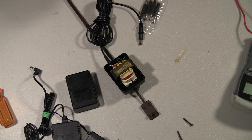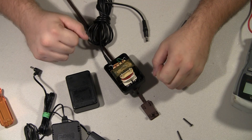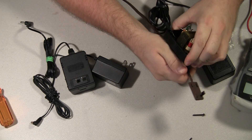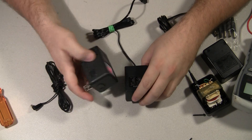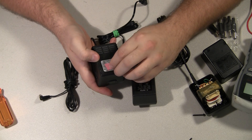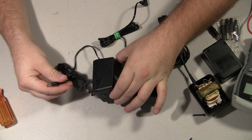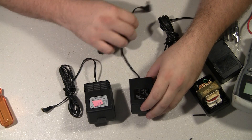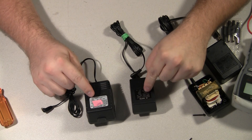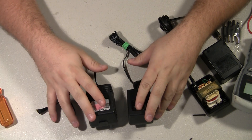Should be fairly easy to do. Now, what if it was the cord itself and not the tip or the transformer? I have a couple of AC adapters here — I've marked this one as bad. It outputs 9 volt DC, 500 milliamp. Usually for an NES I prefer over 500 milliamp. This other one is 9 volts, 800 milliamps. It doesn't really matter the voltage or amperage if you're going to use this as a donor cord.